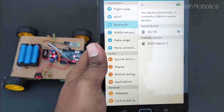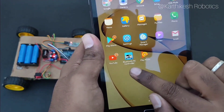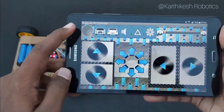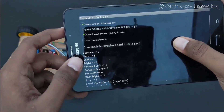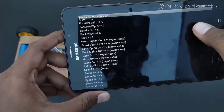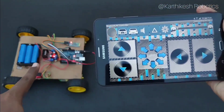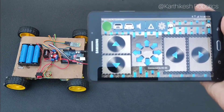Next we need to download the app to control the robot. I have put the download link in the description — you can check and download it. Open the app and pair again. A red indication means the robot is not paired with the app. Go to settings where you can see the forward, back, left, right settings indicated as FBLR — we will see this in the code explanation video. Go to settings, connect to car, and click HC05. The robot is now paired with your mobile phone and you can see a green indication.